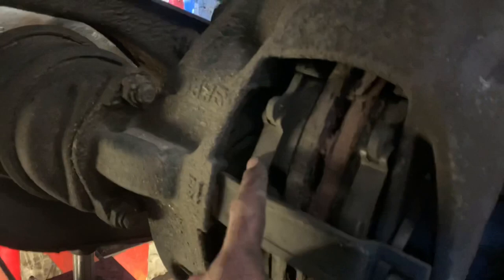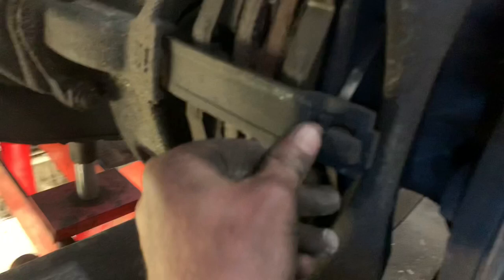Right, you see that there — there's the brakes, there's the brake pads, there and there. See that little clip there. Just push that in and slide that out. We've got to wind the brake off first. The brake winder is there — it's meant to have a rubber bung in it normally, but it's missing. So it's an Allen key, but I'm using the Torx because I can't find the right Allen key socket. You just wind it off and it winds the piston back — that piston there — it will wind that piston in.